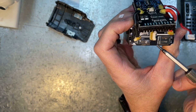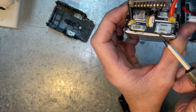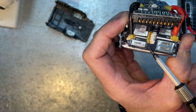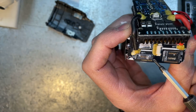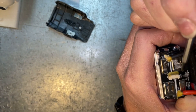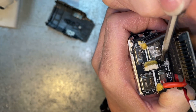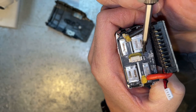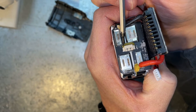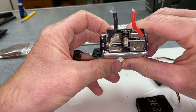Two fried wires — PCB wires. There are little tiny copper wire inlays that go to each cell. Fried that one and one in the back: cell one negative, and cell three positive. I tried jumper wires but that didn't fix it.